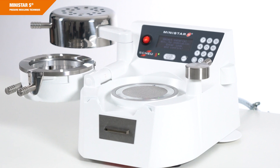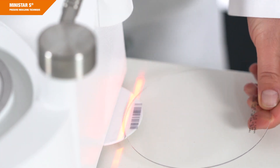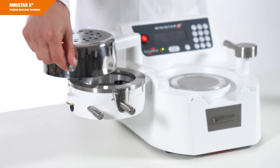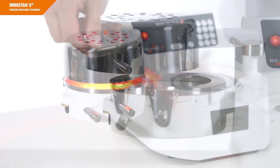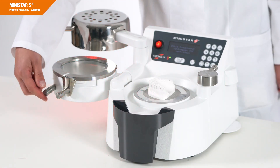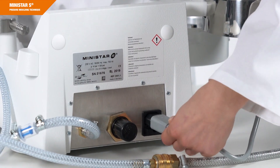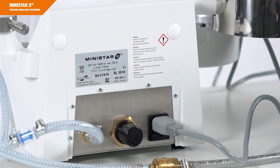The current MINISTAR-S is equipped with a scanner. By entering the corresponding barcode, the functional parameters are read and automatically programmed. The infrared heater is thermostatically controlled and reaches its working temperature within one second. Another special feature is the foldable pressure chamber, which allows one to heat the material side facing the model, which means material processing with excellent pressure molding results. The MINISTAR-S is available in versions for mains voltage of 230, 115 or 100 volts.